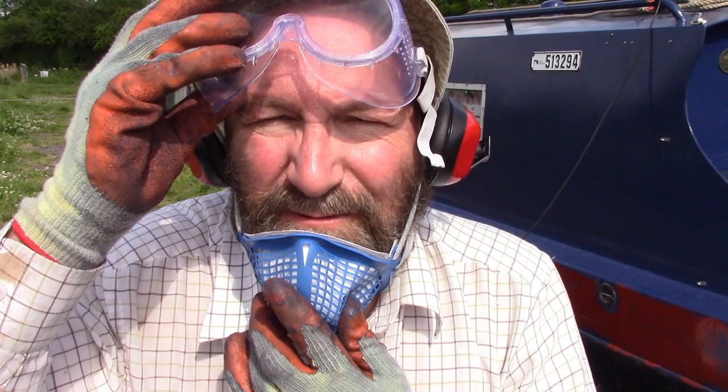This side of the boat is quite badly marked. I don't think I noticed it before because I was working in the shade, but now I've got the sun on it, I can see how bad it is. I'm rubbing down and I'm coming back to bare metal in one or two areas, and the finish is rather pockmarked.